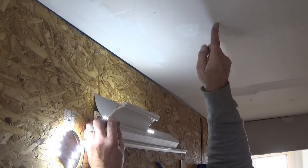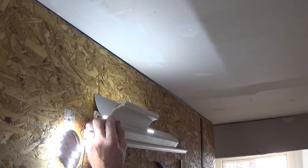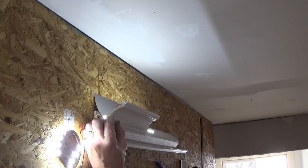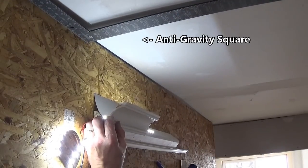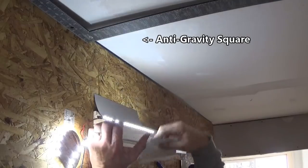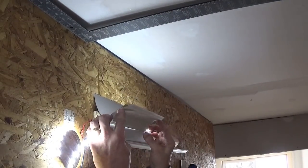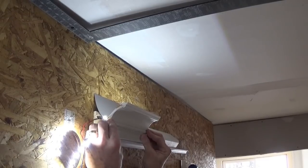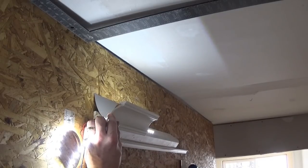Now once you put the cove molding on there, you can see it produces a sharper edge. It's about 12 to 13 inches out from the wall — here we can measure it. That gives me a nice sharp defined edge. This is only one strip; I'm going to put a second strip of lights up there and they'll be controlled separately. I'm not putting them on a dimmer — I'm simply giving them a switch so you have a high and low beam, which is perfectly fine for this application.